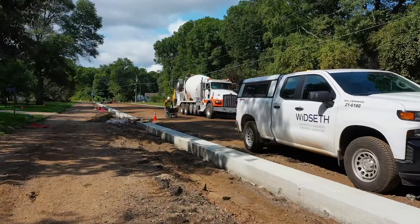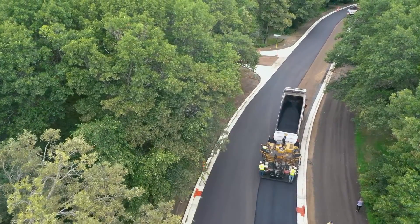The contractor will come in and tolerance the roadway. What we'll do with the blue tops is go out there and set the elevation and location of that crown so the contractor can grade to those blue tops.